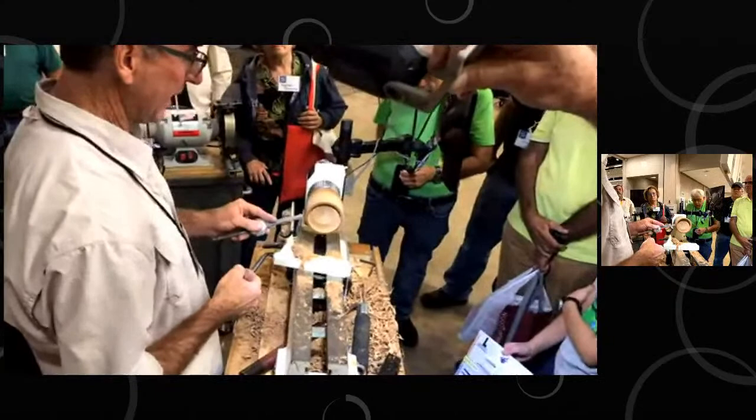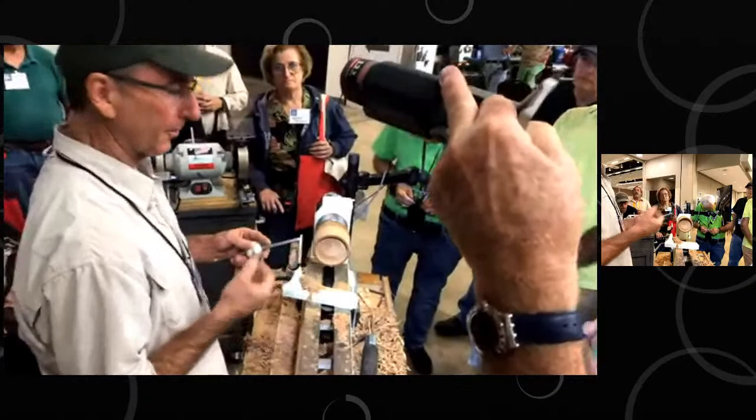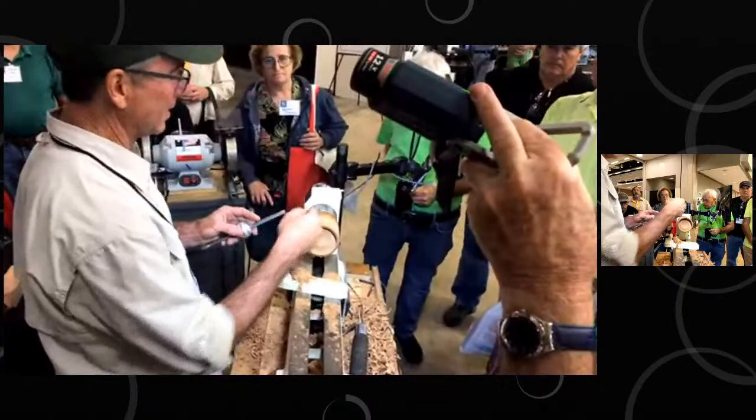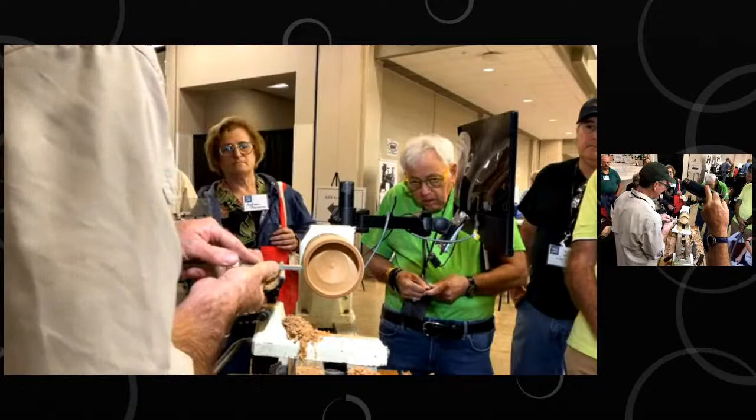Watch what happens. I'm not going to cut. I'm just going to stick the under part of the chaser into the spiral, and it takes it right across. That tells me I've got a thread there. Not a groove, but a thread. How does it make that all the way through? Once I got it into that spiral, it's going to create that thread. So here we go. Just keep that thread going. And eventually those threads will push me up farther into the wall, onto the surface.